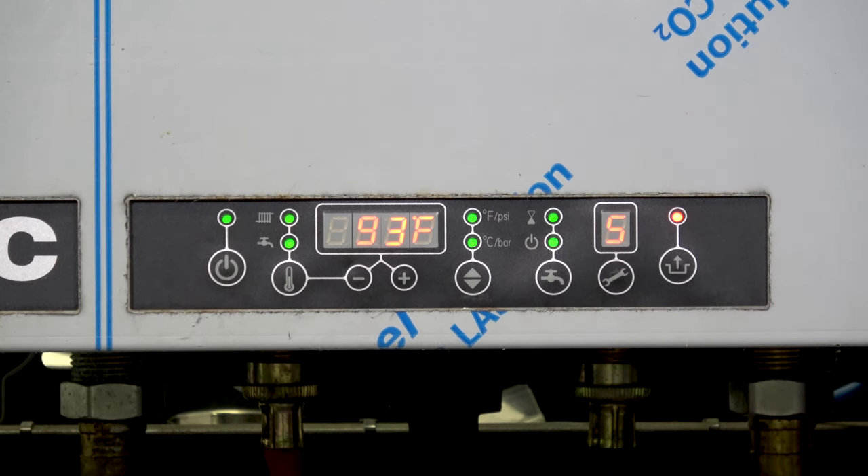The next option is lowercase n — the water temperature from the boiler using space heating water that we're sending to the indirect water heater to heat up the domestic hot water. In this case, we're sending 170-degree water whenever there's a call for heat on the indirect water heater. This is a very good setting — you can change it, but 170 degrees is actually a great number for it.